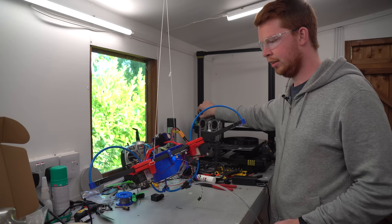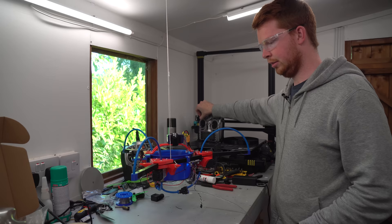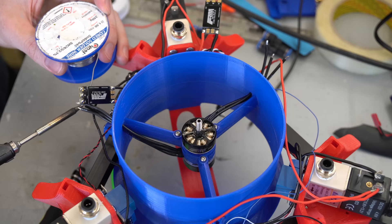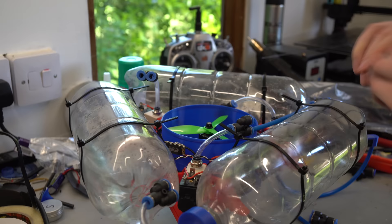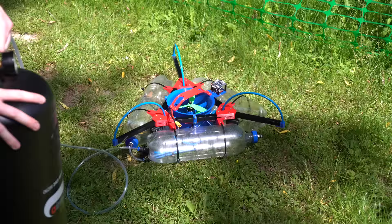I think we need to install the bottles for its own air supply and add some motors. The motors were mounted bottom to bottom and soldered so they rotate in opposite directions, providing net zero torque. The bottles were then mounted to the frame using large zip ties, and then it was a case of plumbing all the bottles and valves together using flexible PVC hose that push-fits into various connectors — making the plumbing super easy and reversible. I then hooked it up to the air tank for a pressure test to check for leaks, which was successful.